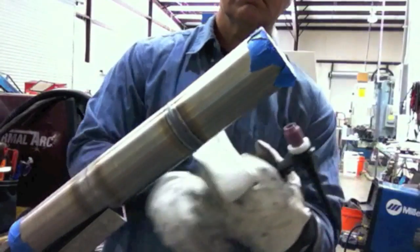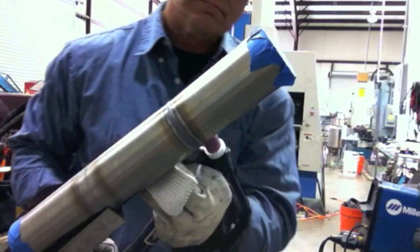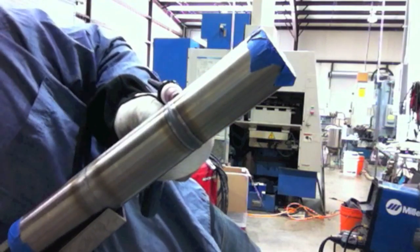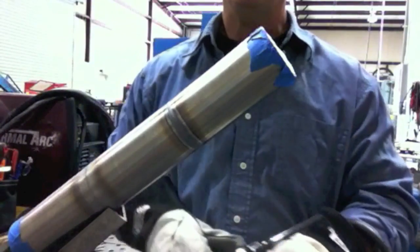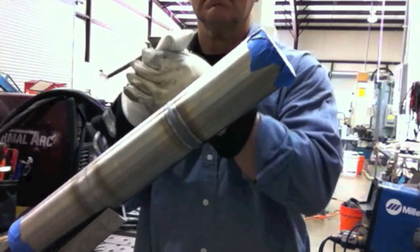I don't have to whip out because all I've got to do is stomp on that little foot pedal. I'll show it to you in a minute — if you look up DIY TIG foot switch you'll probably find it on Google. This should probably be at about 45 to 50 amps. I'm just making tiny little circles and trying to move on without spending too much time — even with the camera in the way it came out pretty okay. You can see where it's nice and silver where I stopped. On 6g, one side you pretty much have to do left-handed, which is rare in the field but is sometimes required to get a job.